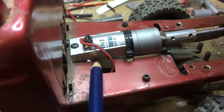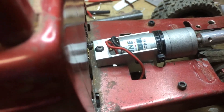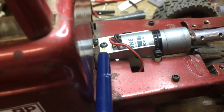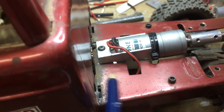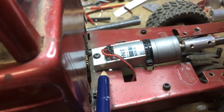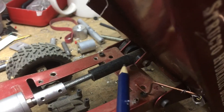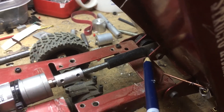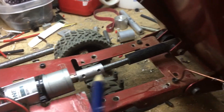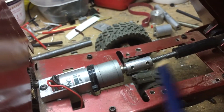Up front here is square tubing that just happens to be the right size for the flat side of the motor, so I would call that square tubing the motor mount. It's got a single screw through here that's going through the chassis of the dump truck, and it's very loose. The hole is clearance drilled in the chassis so that this thing can move around — it needs to rise up back here. As the box lifts, this point here rises, and so this thing needs to change the angle. You don't want that thing to be solid because it would stress or bend something there.